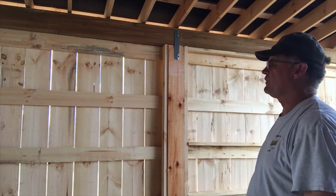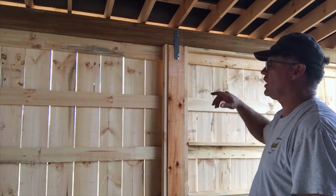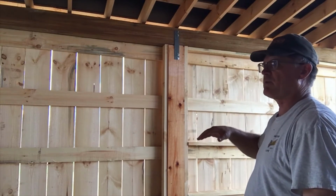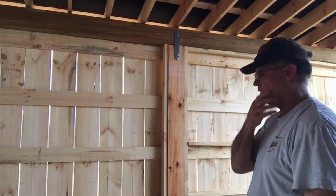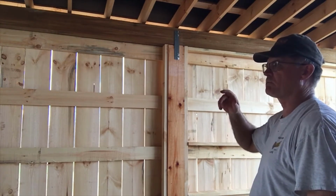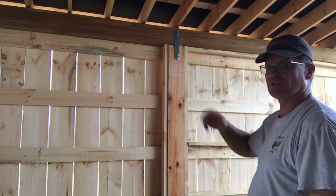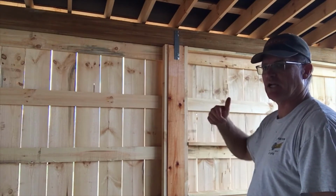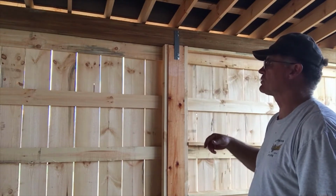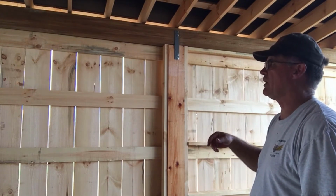Then I'll let it dry for a few weeks, put that Thompson water sealer on it, saw the board and batten, probably put those in the solar kiln to expedite the drying, and then I'll probably Thompson water seal the battens before I nail them. I may even screw them in place. The screws seem like they don't back out as easy.